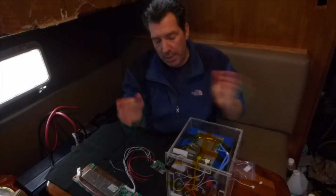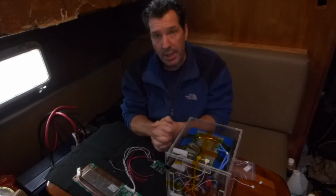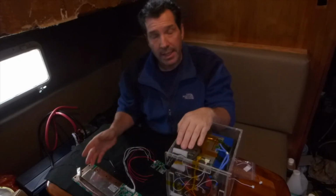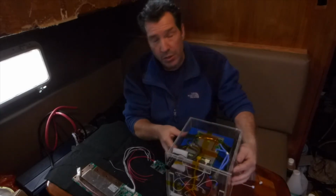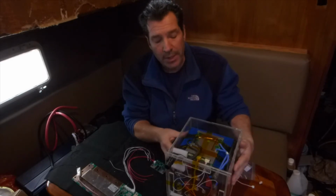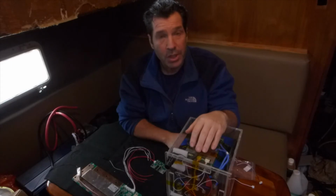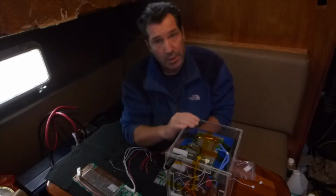So if I were to do another one that was exactly the same as this one and connect them together in parallel, I would be able to get 200 amp discharge out of the 12 volt battery, and if I do a third one, 300, and so on. So I could use these cells to create a 500 amp or higher discharge battery. I would just have to have 5 stacks of those for these particular cells. There are other cells that have higher amp discharge rates individually than these ones, and that's what I'll be using when I build the battery.